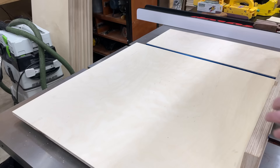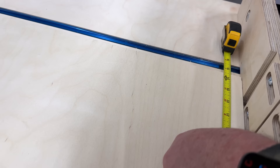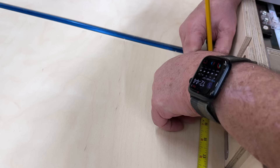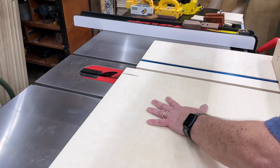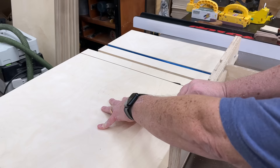I'm going to remove the fence because I need to make a bigger square — something bigger than this sled. The nice thing about this particular table saw sled is I'm not limited in what I can cross cut by the gap between the fences. We just use the quick release front fence and can put really big stock in there, which is really handy for cabinet work. I don't have to lug around a great big heavy sled — I can just put it on here, take that fence off, and make perfect cross cuts on pieces much larger than I could ordinarily.